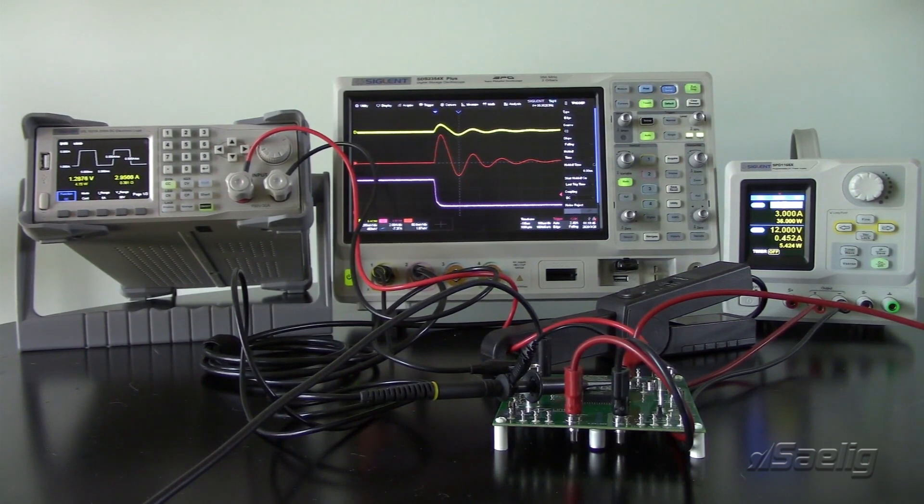That's part one — the detuned side of this circuit. I'd like to show you what the circuit should look like when it's tuned. I'll also be doing another video showing these same step responses using a Bode plot. Step load response is really a brute-force way of checking that the supply you've designed will work properly, and the Bode plot is a bit more elegant and provides more information. You can use both to really optimize your design.